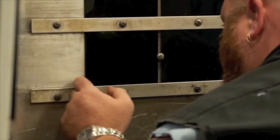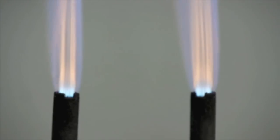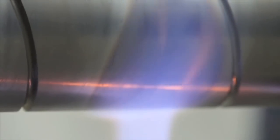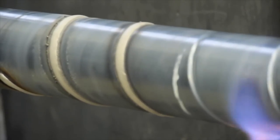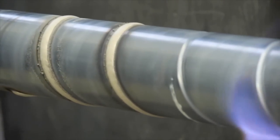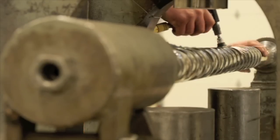The reason you do that is when this goes into operation melting plastics, that's a very hostile, very abrasive environment. If you didn't put carbide alloys on the surface of the flights, these things would wear out in a couple of weeks. It's really hard stuff — once it's welded, we can't machine it. We have to grind it down because it'll just break cutters.